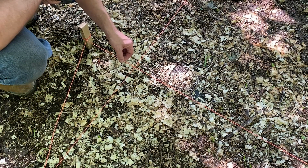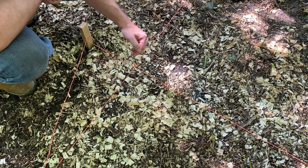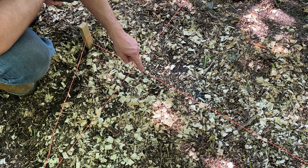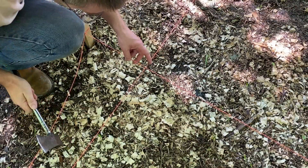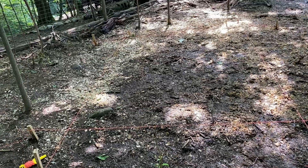I squared this all up now. In order to do that I had to move these stakes down further on both sides. But now it's too big, so eight feet comes right to this mark — I put a little mark on the string. I just have to tap that stake back and move this string back to eight feet exactly on both sides, and then we should be square and everything aligned. Okay, we're at six feet — so we have our rectangle: six feet by eight feet. This is going to be the footprint of the chicken coop.